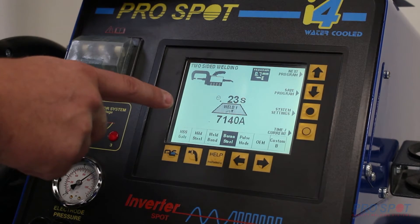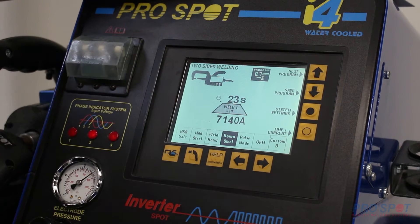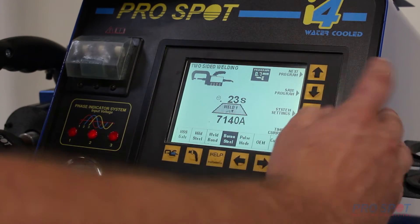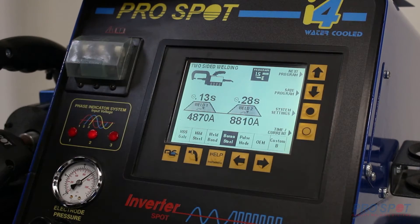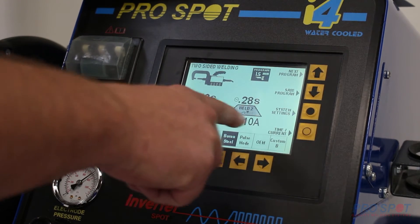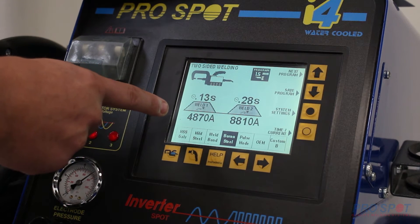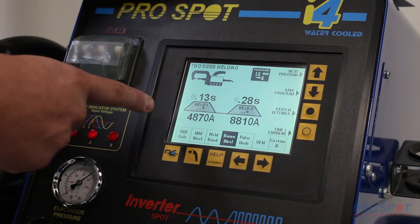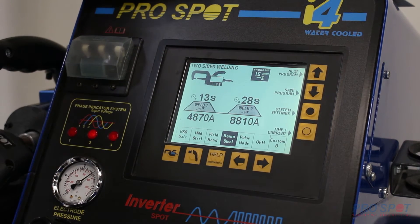When I first put it on it's going to be at 0.7 millimeters thickness and it's going to be a single weld. If I up the thickness and get that to 1.5 millimeters, you'll notice that it goes to a dual weld. When it goes to a dual weld, this is going to be the best application for an ultra high strength steel. It's going to start with a less powerful, shorter weld which is going to heat up the metal before it gets to the actual weld that's going to give it the real pop.